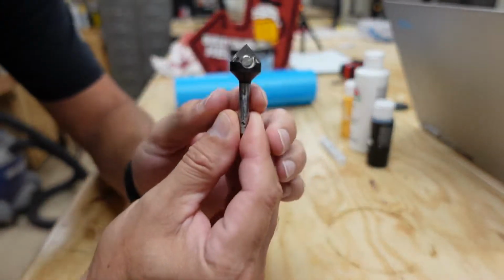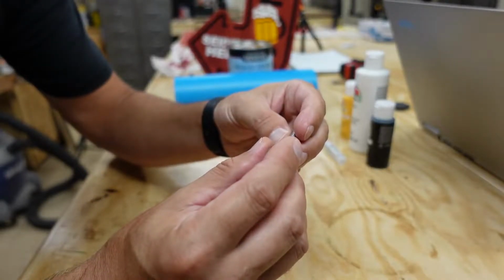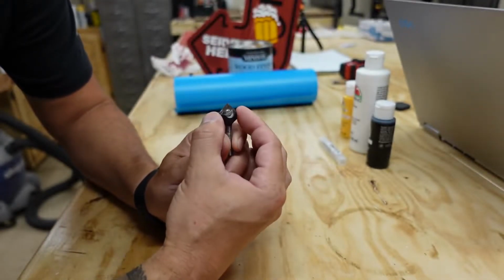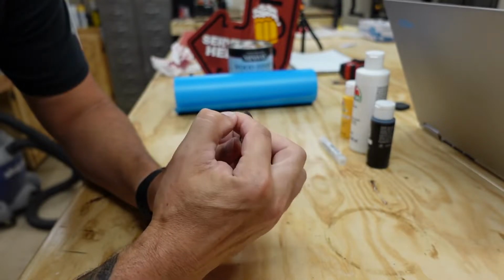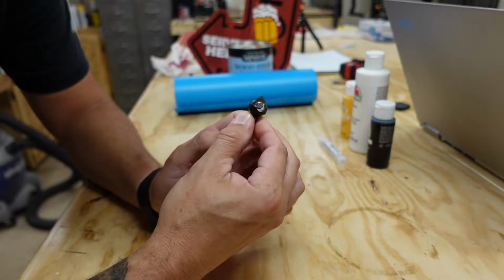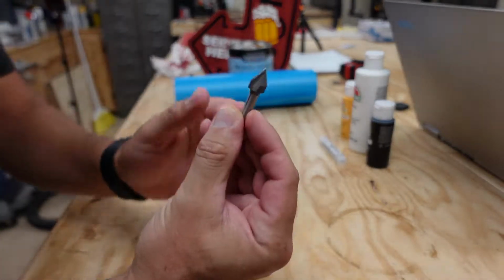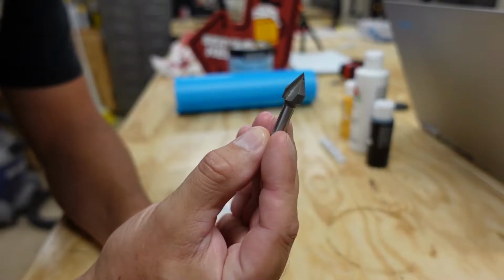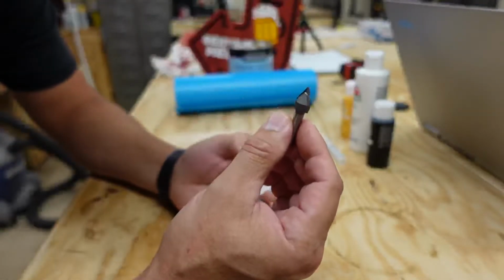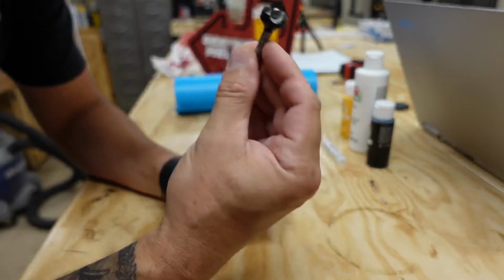The two bits that I'm using, this Amana right here, 90 degree V bit. The number is RC45711, and I'll put a link in the description of this bit. This bit's amazing. It's got a real indexable insert. It's got four different sides, so once one side gets dull, you can flip it. This is four runs without having to replace a full Amana bit like the brazed insert ones, like this one right here. This is a 60 degree, but I'm telling you, if it chips right here, or it gets dull, the whole thing is done. You can resharpen these if you know somebody that can, but these I recommend. They cost a little bit more, but it saves you money in the long run if you use this a lot. I use this one a lot.